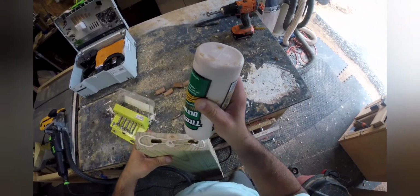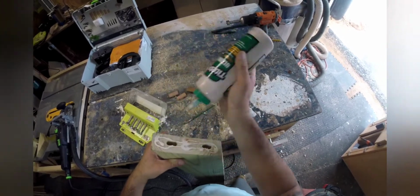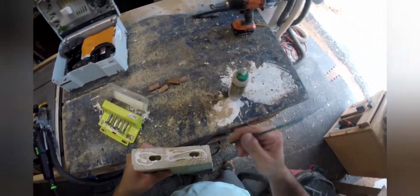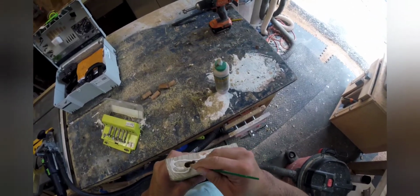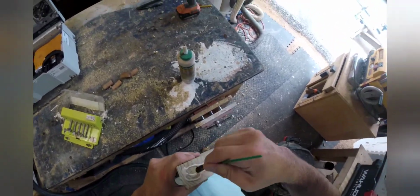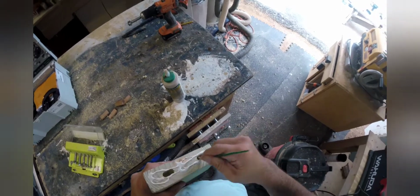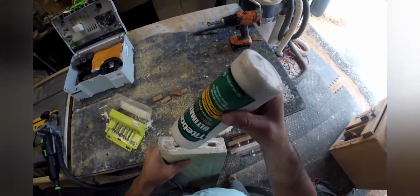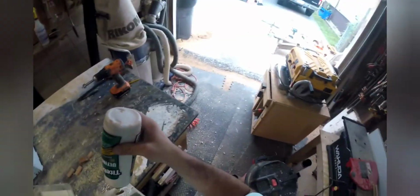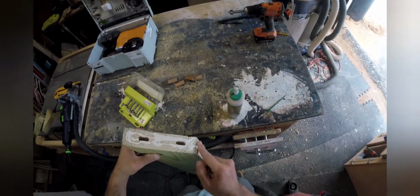So here I'm going to pre-assemble the bottom rail into the center brace that's going up and down, or the length of the steps. So this is what I'm doing now. I'm just putting some glue in the domino mortise, and then I'll put the tenons in. Like I said, these are going to be 10 by 50s, so they're going to be bigger dominoes for added strength. So that's what I'm doing here.